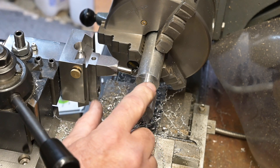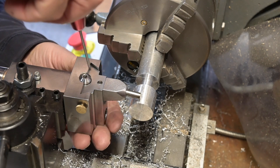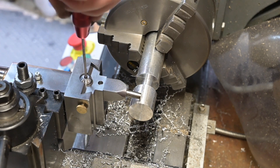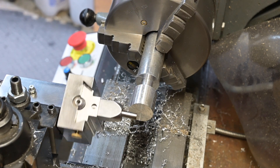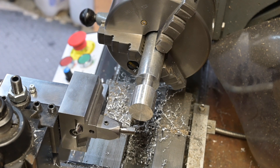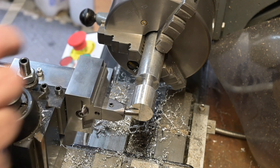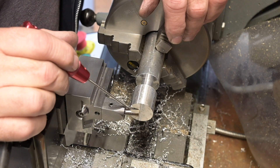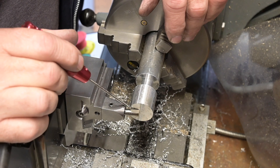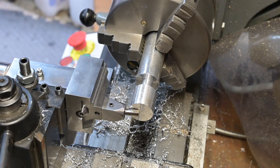What I've got to do is line the bottom of the tool up on the top of this piece, so it's touching the top. So what I do now is move the carriage over, turn that horizontal, move the carriage in and I instantly find that the tool is touching. But that might not be an issue for the cut because by the time that gets in, that won't actually touch when I cut it. So I lock the carriage off there and then wind the tool out.